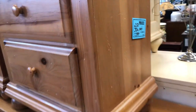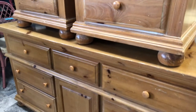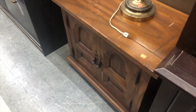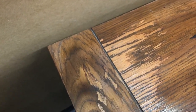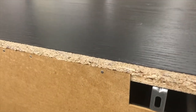Now let's look at this three-piece set with the dresser and the two nightstands. You can tell this is real wood not only from the knots that you can see, but the random patterns in which the grains are running — these look like 12-inch wide pieces of lumber put together. Here's another nightstand in terrible condition where the finish on top is flaking off and the veneer is actually lifting off the bottom. If you don't have experience repairing veneer, stay away from it. Here's another nightstand that looks like an IKEA piece — particle board with a veneer on top. I suggest staying away from particle board altogether; they not only split and crack easily, but once you move them, they fall apart.